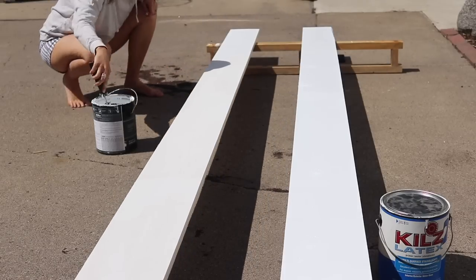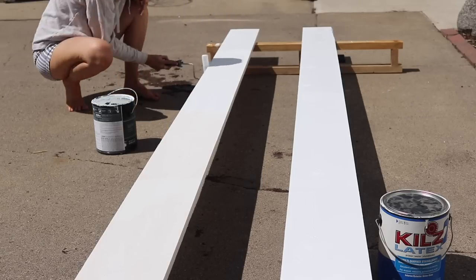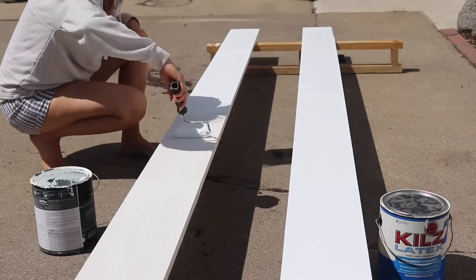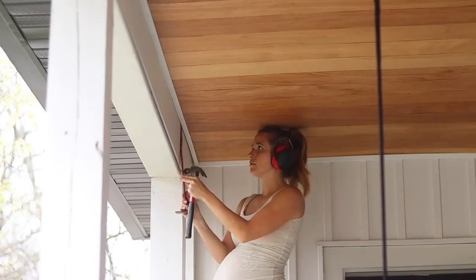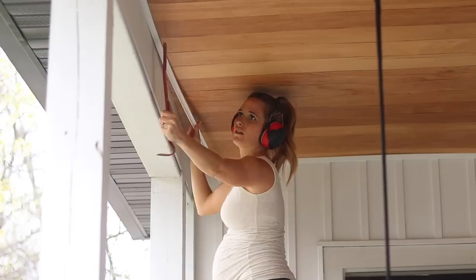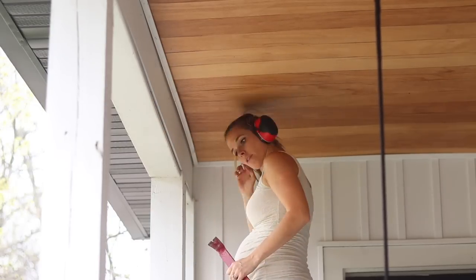So you can see this is the paint and primer I'm using. I have our exterior and you can find both of them at the Home Depot, so I'll link them in the description below. Last year when I planked the wood ceiling, I just put this little corner piece of trim up, but now I have to remove that because the 1x8 that I install up here is going to cover the edge of the wood ceiling anyway.